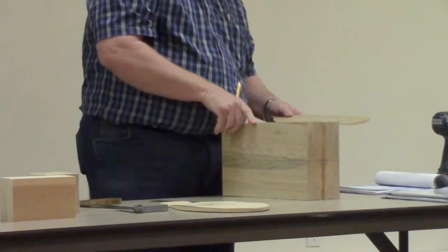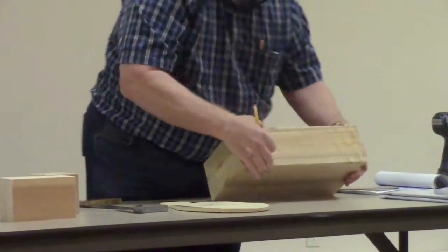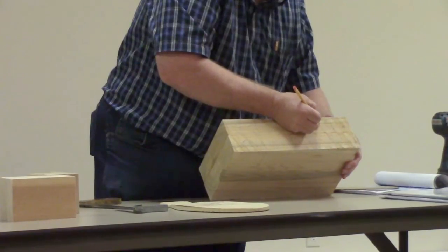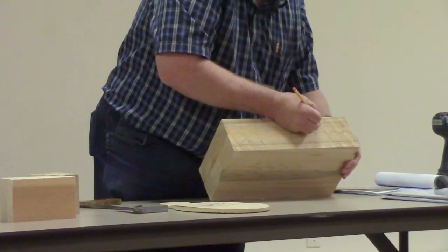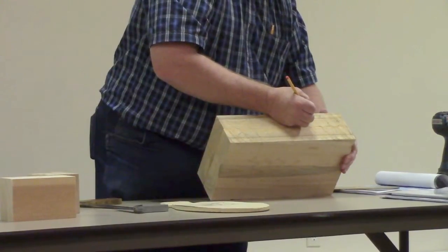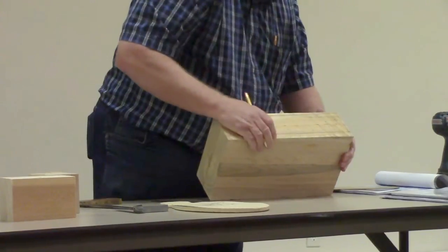So one thing I want to maybe stress is when you make cut number 4, number 5, try to be as accurate as possible here. Don't let one overrun the other way, because then you're going to have a little divot that you're going to grind out or modify or put epoxy in. So take your time and get that just right. Okay.